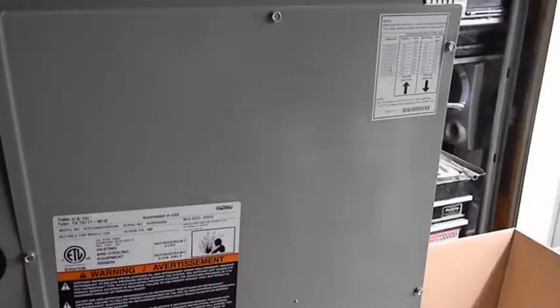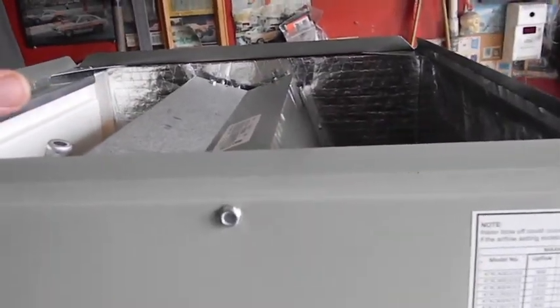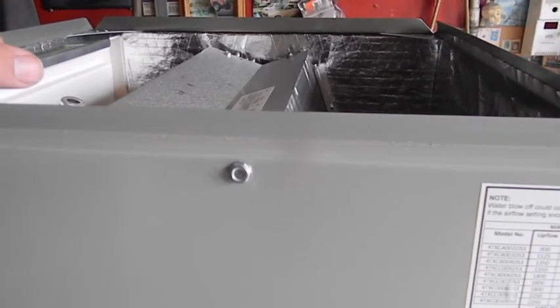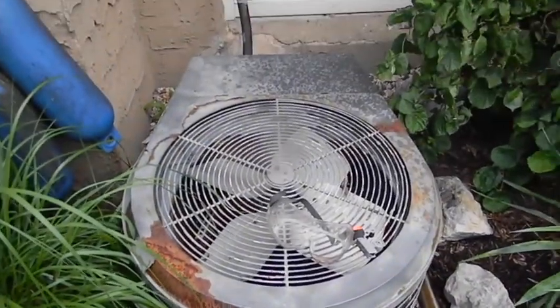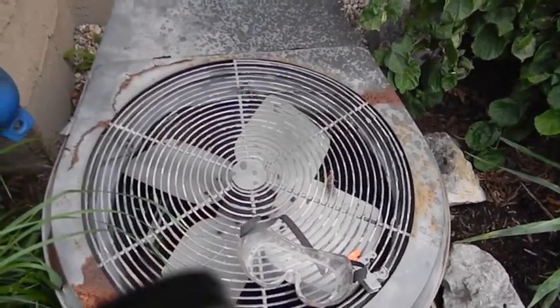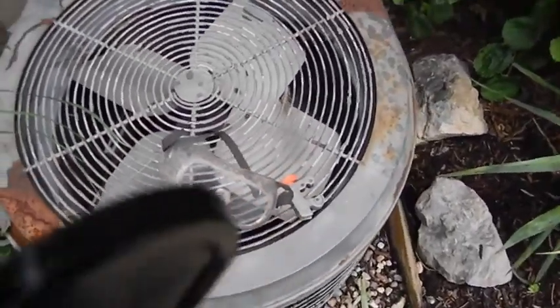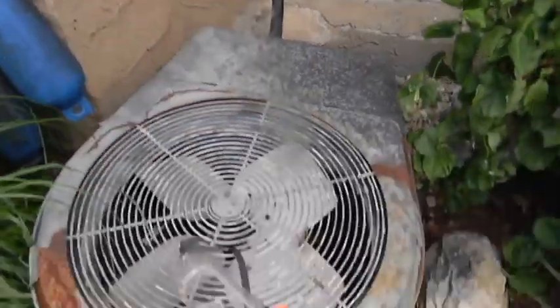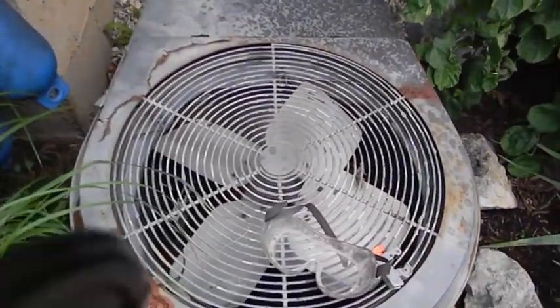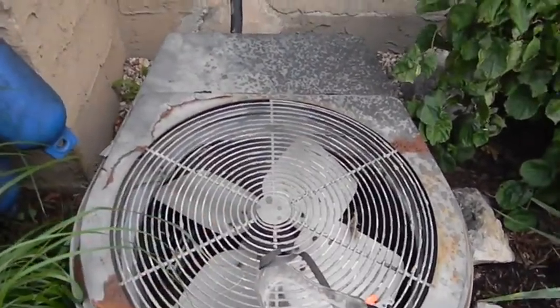In a perfect world this slips into the duct, I put a bunch of screws in there with some foam and we move on. The other unit — I checked it at the valve, it's 100% empty, which I thought, since it leaked out at the end of last year. Just cut the two lines, disconnect the electrical, and we're gonna have to open this up for the bigger pad. I just want to get it out of here.